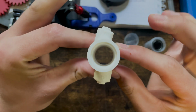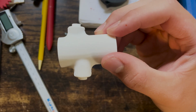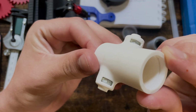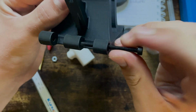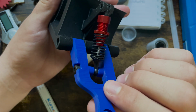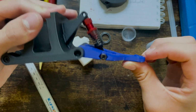The hub has this large cylindrical body to house the bearings in the shaft. On the top and bottom, it has differently positioned connection points, each of which has a hex nut slotted inside. I configured this so that a bolt can go through the ball joint inside the hub and tighten against the nut inside. The suspension arms are held to the frame with M4 bolts and nuts, same as the suspension. After some iterative designing, I moved on to work on the body of the car in CAD.